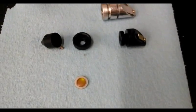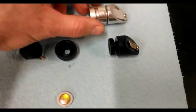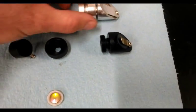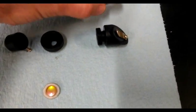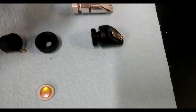One of the most important upgrades you can do to these lasers is add air assist to it. On the top here is the original assembly, and all you do is take it apart. It's mounted in through this area here. Be very careful of your mirrors and lens.